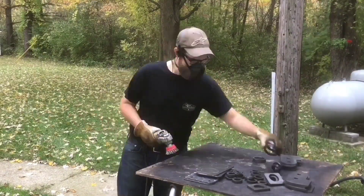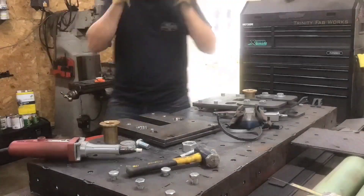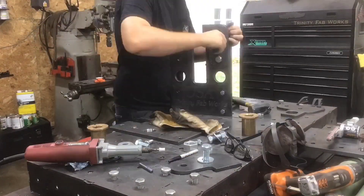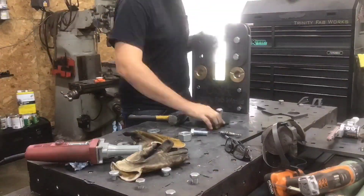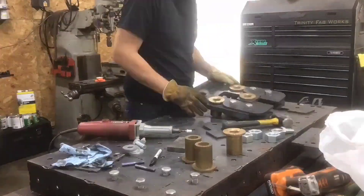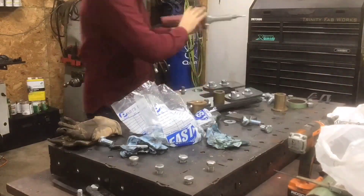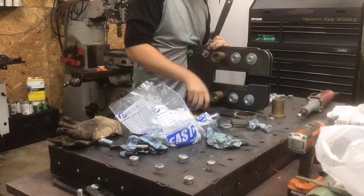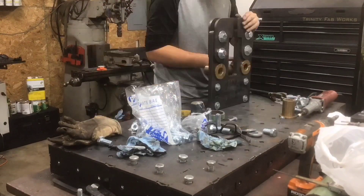I'm going to go ahead and clean the back of these parts up. Some of these are pretty small and I didn't have a magnetic chuck yet when I made this video — that magnetic chuck has saved my gloves, my fingers, and some time by being able to lay out a lot of small parts at once. I turn the chuck on and knock all the dross or slag off the back of these cuts, then flip them over and clean up the front side. It's definitely sped up the process quite a bit.